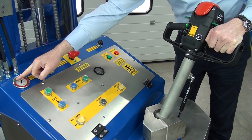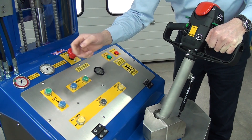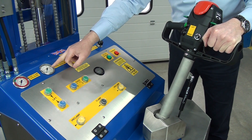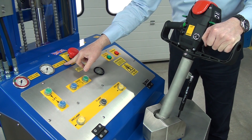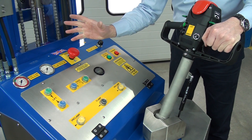The needle goes up into the green section — it must always, when you're lifting a roll, be in the green. If the pressure drops, it means you're losing clamp pressure, and you should put the roll down as quickly as possible. This one is the actual anti-telescope clamp pressure — that's the pad at the front that pushes on the outside of the roll.